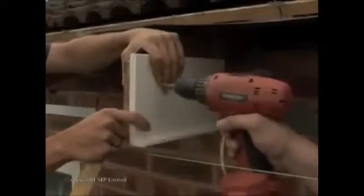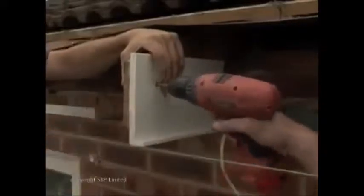Each hanger will be set 10 mm above the height of the last brick course, so that the soffit board can be positioned between the bricks and the hanger. Every rafter foot now has a hanger securely attached, ready for the fascia and soffit board.